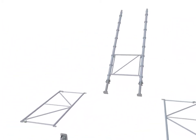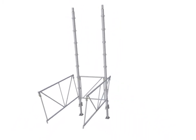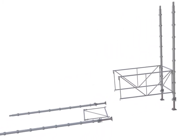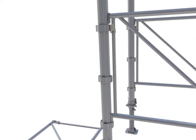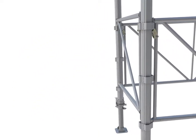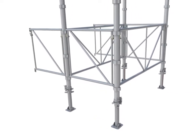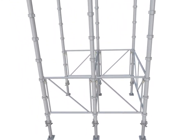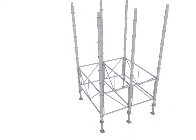Raise the two leg frames to vertical and attach the side frames to the assembly. Locate the remaining legs to the ends of the frames and attach the final frame to complete the assembly. Where additional bays of leg assemblies are required, add side frames to the existing assembly and then connect the legs and frames. Continue this sequence until the final table size is reached, ensuring the table is square and all frames are level.